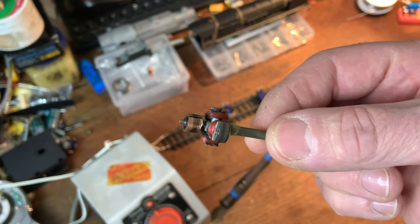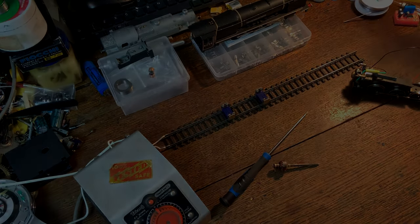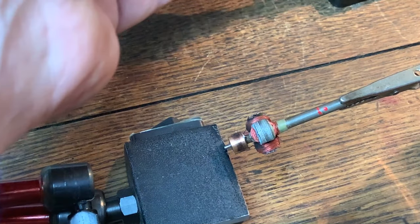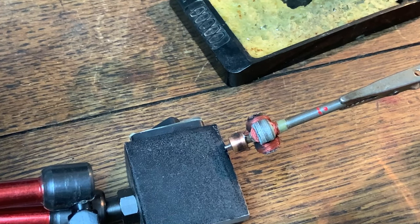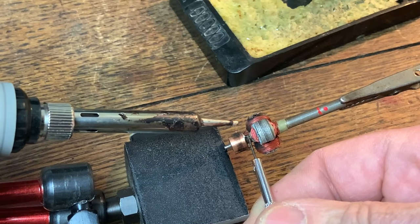I'll pause the video slightly, get a soldering iron warmed up, and see if I can get the camera positioned to show you me unsoldering these wires and freeing off this cracked commutator. I'm only really going to get one shot at this. My soldering iron says it's warm enough. I'm cleaning the tip on a little bit of wet sponge and then just melting the slightest amount of new solder onto the tip. I've got this little screwdriver - let's see what happens.